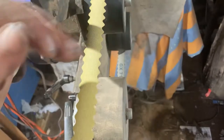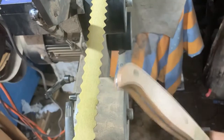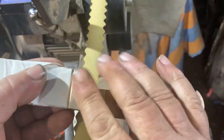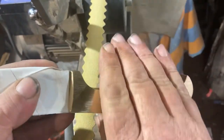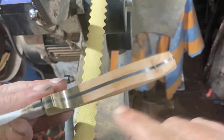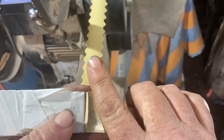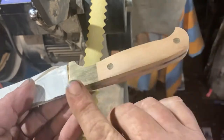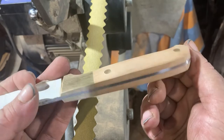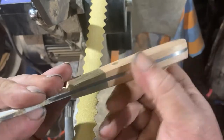Using the scallop belt next — this is the coarsest one, which is 120 grit. This is the one I'll put the final shape on the handle with; everything after that is just polishing up. I just need to soften these edges — I like a little bit of curl underneath. At the moment it's a bit square, a bit wide, so I want to soften that back. Soften these edges around that because that sharp piece of brass is no good, and again soften over the top.